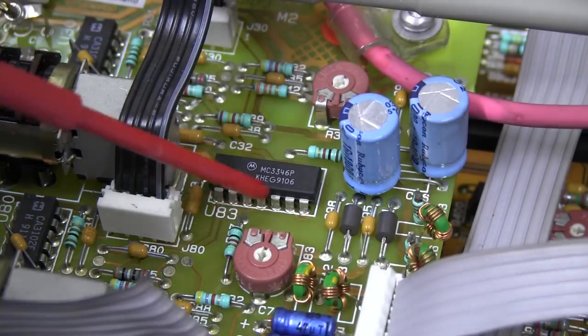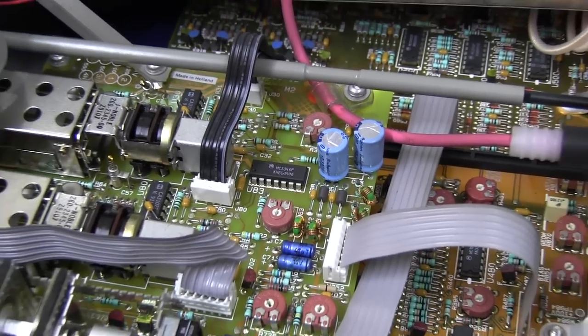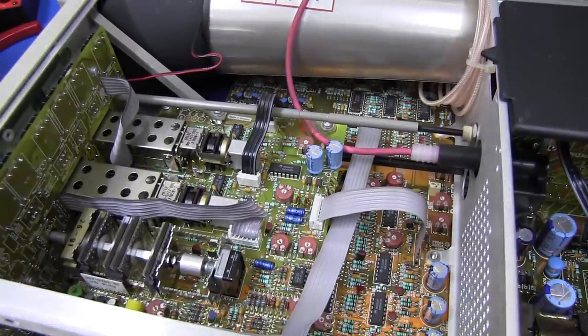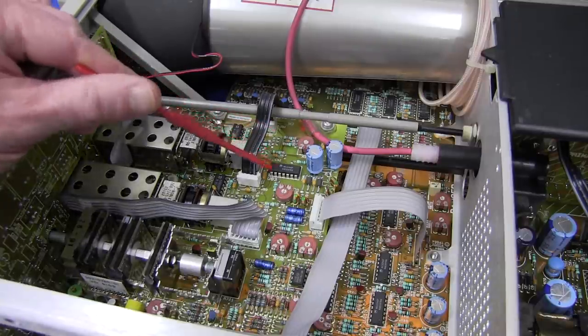For example, the Motorola MC3346 is a transistor array — it's got a differential pair plus a couple of discrete transistors in there. They've decided to use an IC instead, maybe for thermal matching. If it uses all discrete components, it makes it much more serviceable. Because if you get one of the more advanced Tektronix scopes and they've got a hybrid module in there that fails, you are screwed. But even if the transistor array failed and you couldn't get it, you could bodge up a circuit to replace it.